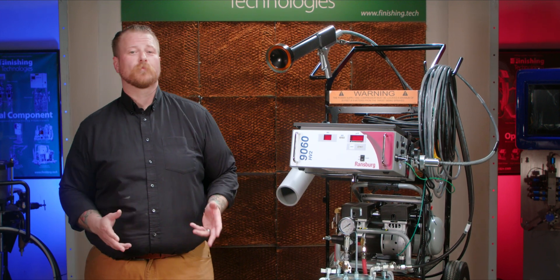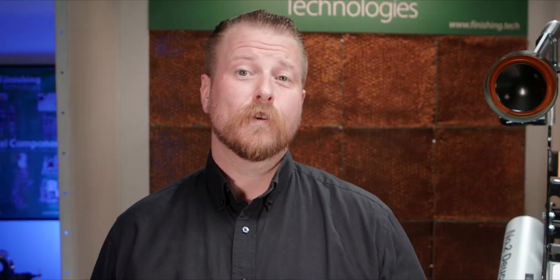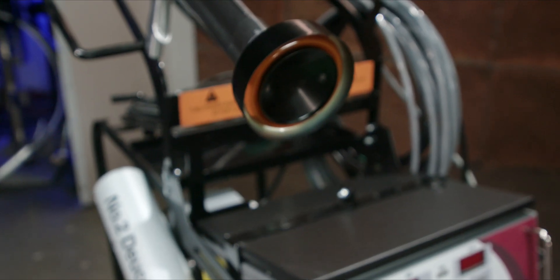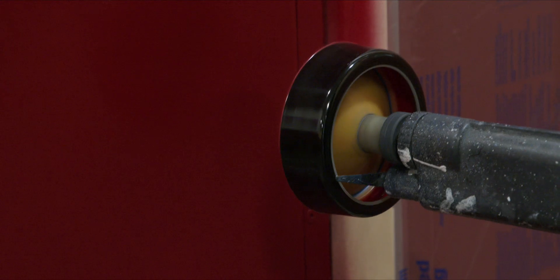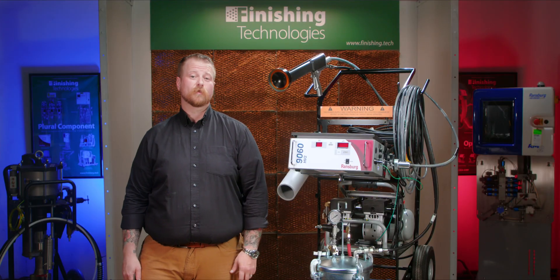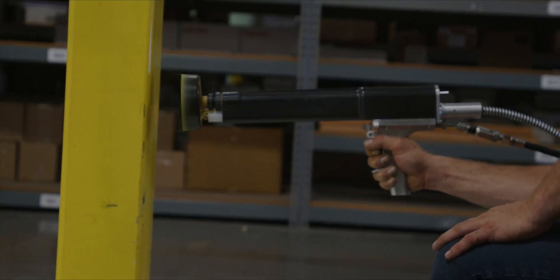Let's talk about how this system is unique to pretty much all other applicators and how it produces results in the environments I've mentioned. First of all, the gun doesn't use air or pressure to atomize the coating. This system instead uses a special spinning bell, which is coated with an electrostatically conductive coating that enables the paint to become charged. This keeps the overspray to nearly zero while utilizing the electrostatic effect so that the paint only reaches the substrate you're targeting. As the bell spins, a combination of centrifugal force and the electrostatically charged field disperses the paint across the bell's surface, which is then emitted into the air as an atomized charged cloud with droplets so tiny you may not actually see the cloud of paint.